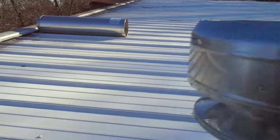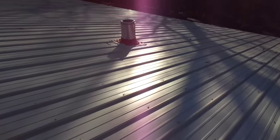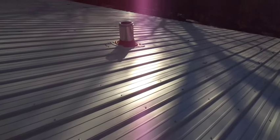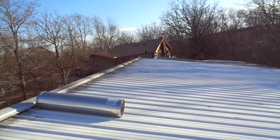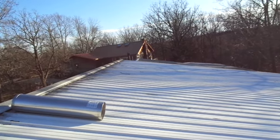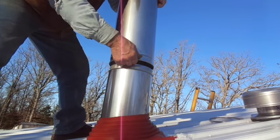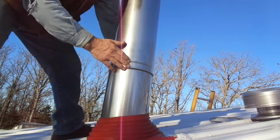Come on up a little bit higher — here's my Belmont cap, had that tied onto my belt. Here's the ring to attach the two pieces of pipe together. Down here is my flashing and the stub of chimney sticking up through there. I really don't need another three-foot section, but three-foot and two-foot were both the same price, so I just went in and bought two three-foot sections. There you can see the back of my hacienda over there with the 24-gauge standing seam metal roofing on that, as well as my other old shed in front of this one. I stuck that on there and gave her a rotate — that's locked in place.